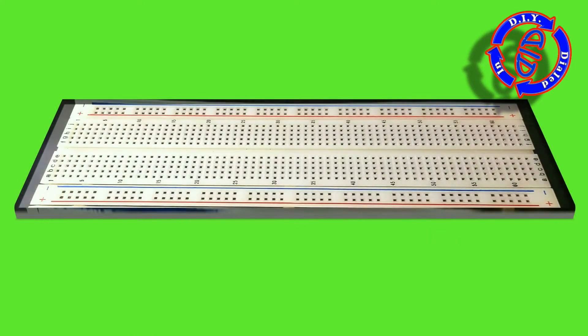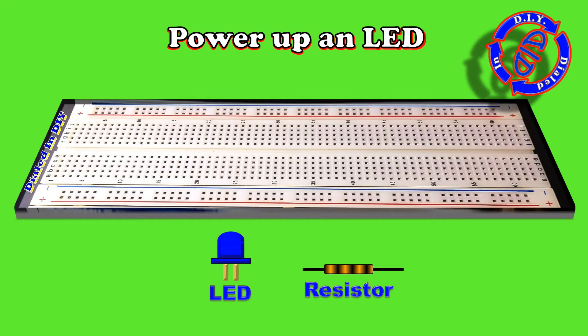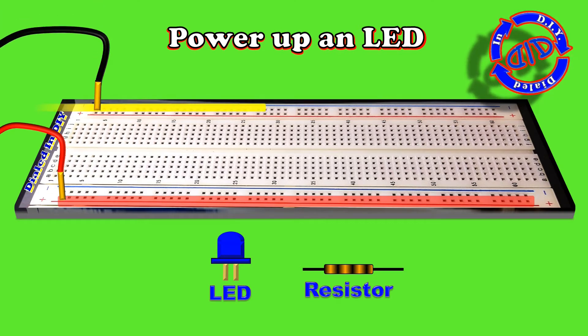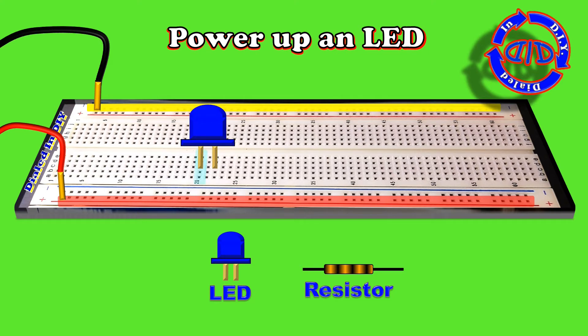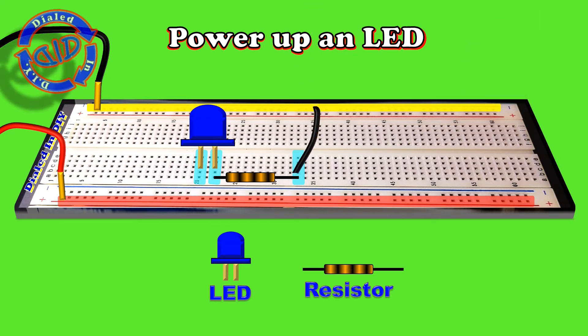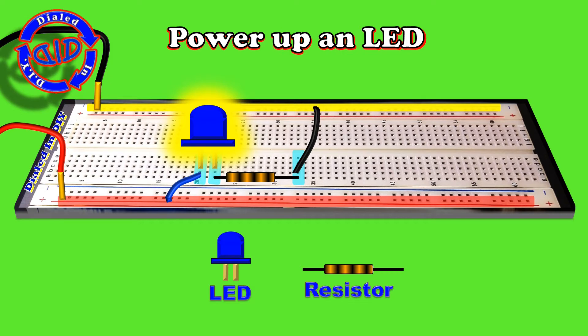I think the easiest way to make all of this make sense is to use an example, and one of my favorite examples is powering an LED. Usually my first step is hooking my power to the board, so I will take a positive line and hook it up to a power rail on the positive mark, and then I'll take my ground and hook it up to a power rail on the opposite side. I will go ahead and plug an LED down to make sure that each of the leads hits two different nodes, and then I like to remember which one has the positive connection. I will then hook up a resistor if necessary to the negative side before I connect the power to the negative rail, and then the positive rail, and as soon as you get it hooked up to the positive rail, your light comes on.